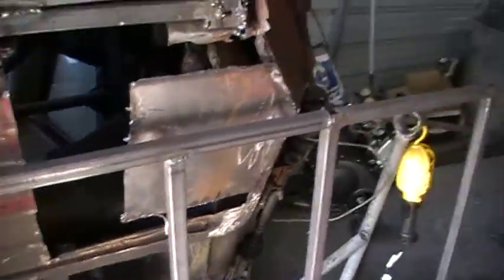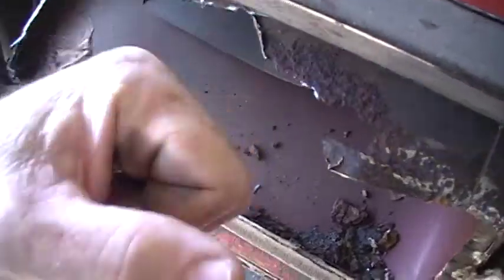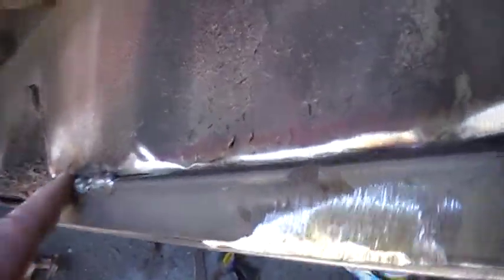Let's see what I've done — I had multiple choices to consider and opted on the welding frame. It's gonna add about an inch, a little bit more than an inch, to my car. I'm either gonna fiberglass this or take the lip off all the way down and fiberglass that to this one-inch tube. You can see where I made the brace coming off of this rail here, coming down along the channel of the car — it's gonna be welded on this side.